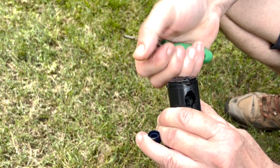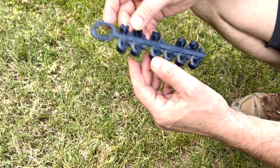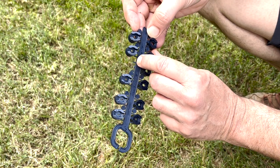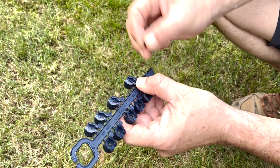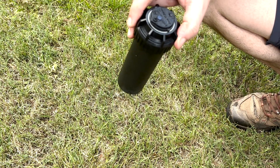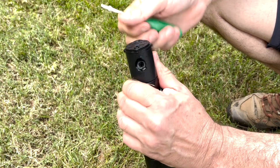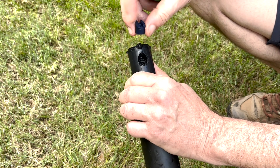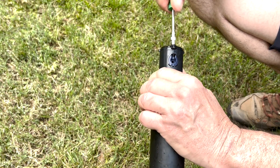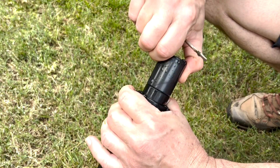We also want to take out the little tab that shows the gallons per minute — the nozzle size — and put a new one in. We have our nozzle tree here which has a variety of options. They indicate the gallon per minute sizes on the tab. What we had in there was a 2 gallon per minute, so let's put a 3 gallon per minute in. We pull the nozzle off and the little tab, put our new tab in, turn the tool 90 degrees and pull the shaft up enough to grab it. There are tools available to hold the shaft up if you don't have enough hand strength — it does have a spring with some resistance. Then we run our screw back in enough to hold the nozzle in, and turn it to the left limit.